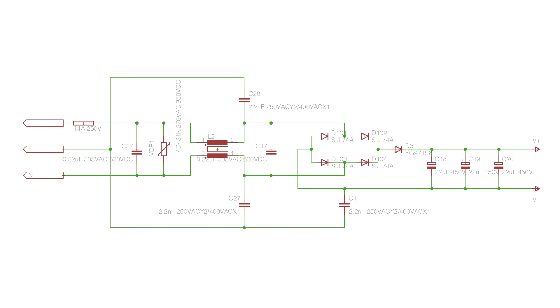As you can see it all appears to be rated fine for DC use. The varistor will clamp a little higher than 350 volts — about 380 — which is fine, seeing as the supply I want to run this off is a maximum of 350 and it'll settle down to about 300.